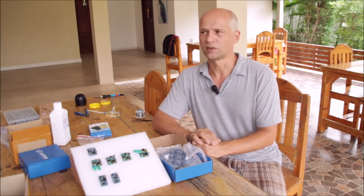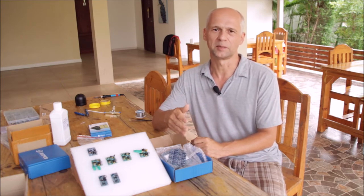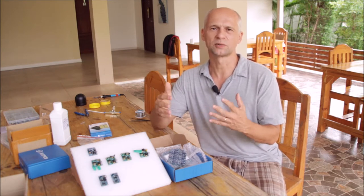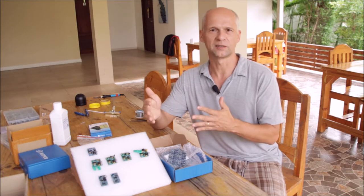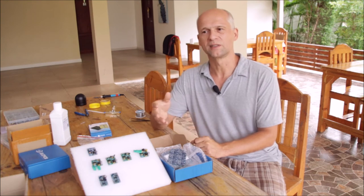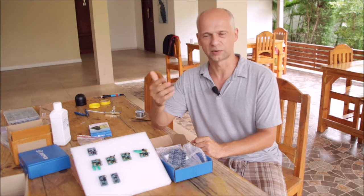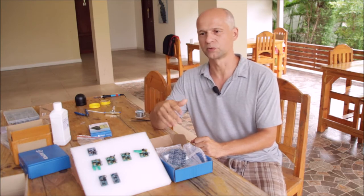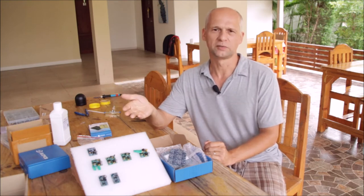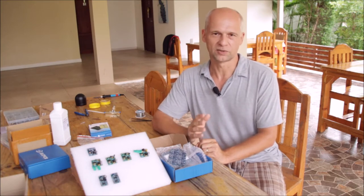When it comes to internet of things, I found out that those applications sometimes require a very long delay from the microcontroller just to stand by and wait for an answer from an internet server, and those delays can be sometimes up to 25 seconds. So for 25 seconds the microcontroller would just wait, not do anything, so it couldn't also send a live pulse. For an outside viewer it would look like the microcontroller is stuck, while it is not — it's just waiting.